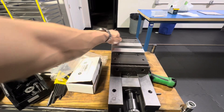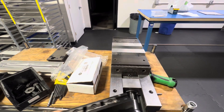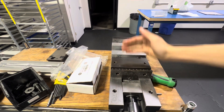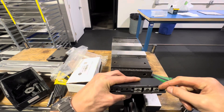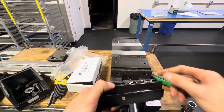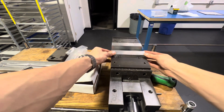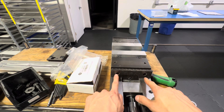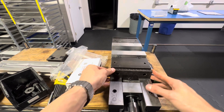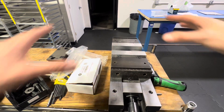What's also cool about these jaws is you can fix other attachments — for instance, these tiny little low-profile clamps. Sometimes what we've done is cut really large plates sitting right on top of the surface, from here all the way up to here, and then clamp with these super low-profile grips. So there are a lot of different applications. This jaw can be fixtured onto the dovetail side as well. And if you're not used to this dovetail style, there's also the conventional front style of jaw where there's just two bolts in the front — that's super common, kind of the old industry standard. But I find the dovetails are much quicker and way more repeatable. So that's how you do a single station jaw.